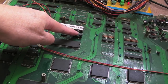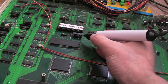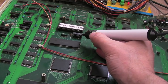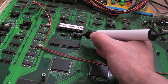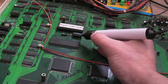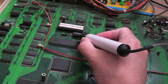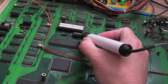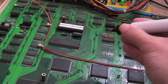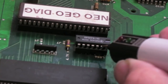There are a number of things - I burnt out a trace. I didn't capture it, otherwise it would have been entertaining to see. I burnt out a trace by probing with a logic probe - you've got VCC and the pin next to it, and it just so happens the first two pins on the last gate here - those two inputs are tied to ground. Coming in at an angle from the VCC pin to those pins caused a short - the power went off and I could smell an awful smell.